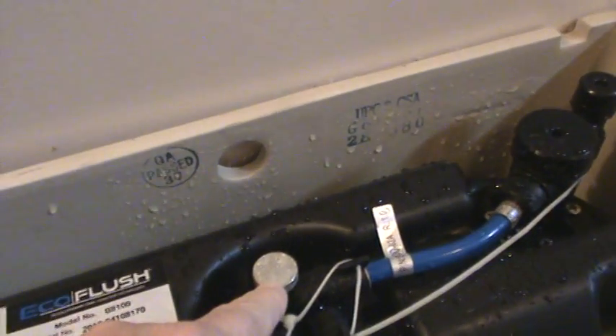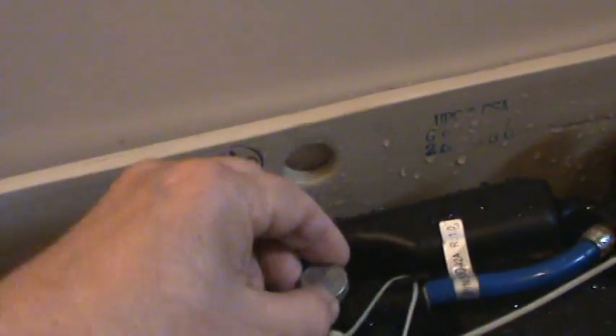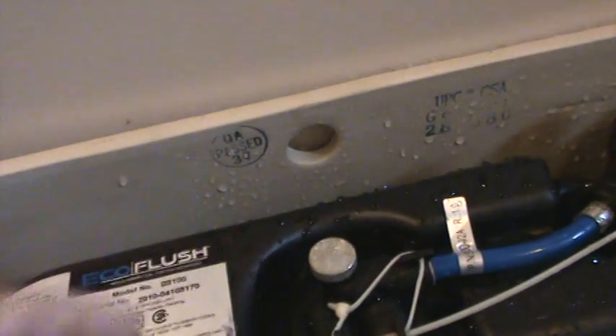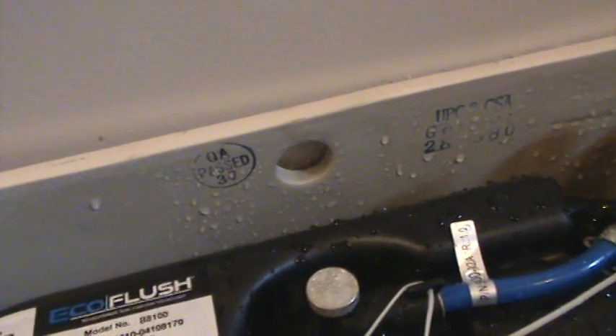So it's this way to be turned back on. Anyway, they call it a knurled nut — this center thing here. When you have the water off, have a towel nearby and put it over the top of the thing, then you turn it counterclockwise to release it. Water will shoot out of there, but if you have the water off it will stop after a certain point.